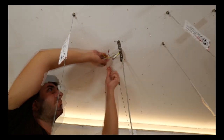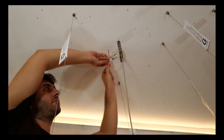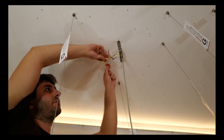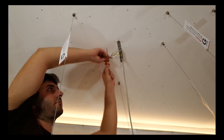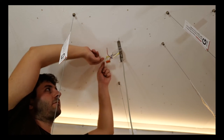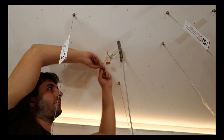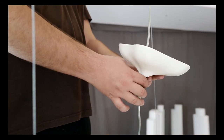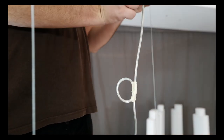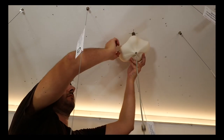Now you must connect the cable from the main power outlet to the main power cable of the chandelier using a terminal block. Tighten the plastic screw on the strain relief on the main power cable until you feel that the cable can no longer be pulled back. Now carefully lift the porcelain mask into its final resting place on the ceiling and fix it in place using the mask nut and the mask nut silicon gasket.